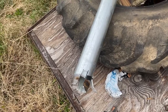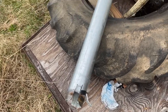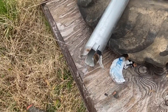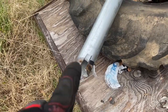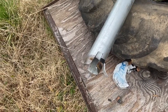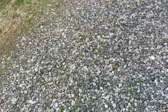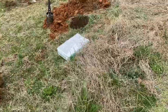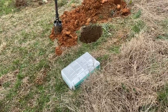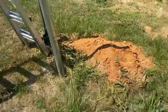I'm not going to go that heavy duty today because I'm going to put so much concrete at the base and around this that I shouldn't have that problem. This is my own photovoltaic power at this point, so I'm not going to go overkill — there's going to be a lot of weight and a lot of concrete holding that in place. I'll wet that concrete, put about six or seven inches in the bottom, then slide the pole down so it's a solid form. I'll grab one more bag of concrete to get it rough set today, and you can see the pole is concreted in now.